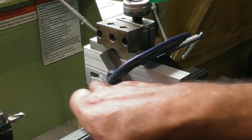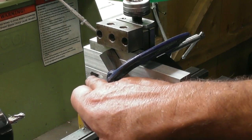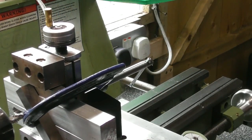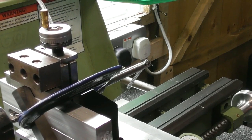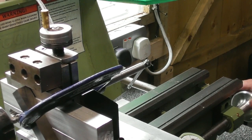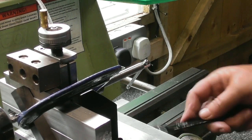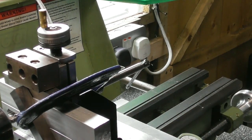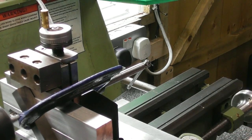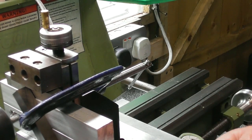So I've milled so far. I found one of the holes, and I basically am moving back and forth 15mm, plunging in 1mm at a time. So yeah, I think my current position is 5.5 in. Where are we? Yeah, it is. So let me just go in to 6.5. Lock the carriage. Check everything's all right. Yeah. Start the cutter, and I'm going 1mm at a time, so yeah, not going mad.